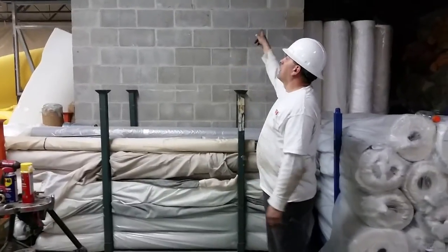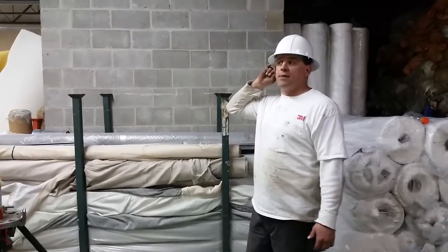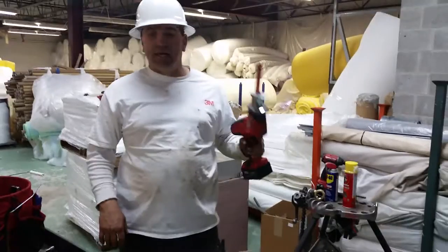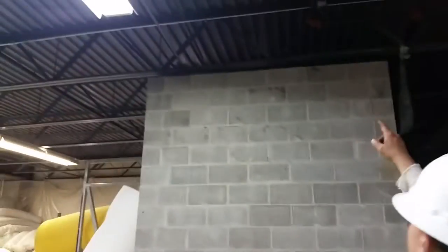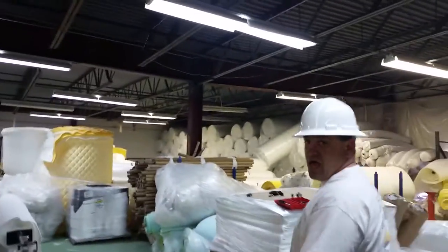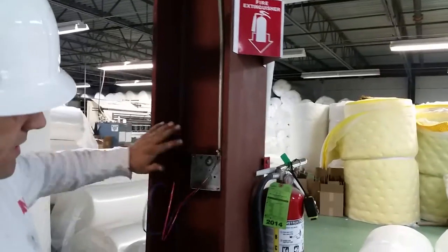It's out of the way by that brick wall. I'm gonna hang it back there. We're gonna have to vent it out of the roof — I'll show you the vent in a minute. I used to have the right size hole saw, but they stole it when they stole my van and all my tools. So try cutting a circle with this. I got it in there, but it's not user-friendly when you're trying to cut a tiny little circle. But we got it in there and vented that one. The pipe going out uses a 120-volt thermostat — not 12 or 24 volt — so we piped that all the way over. I asked the guy who's gonna use the unit where he wanted the thermostat, and I recessed it in here so it doesn't get knocked off.